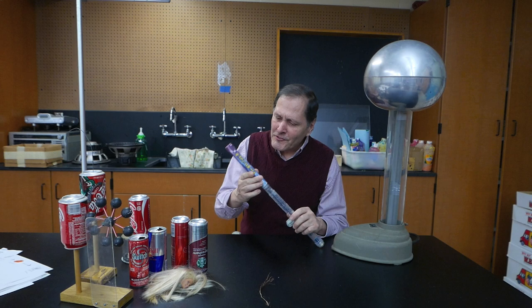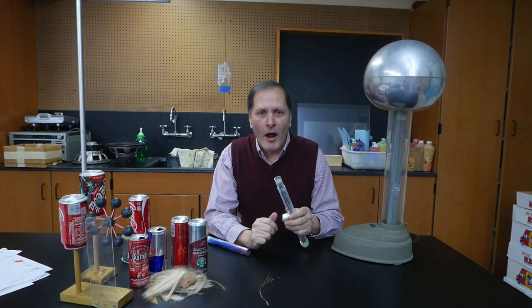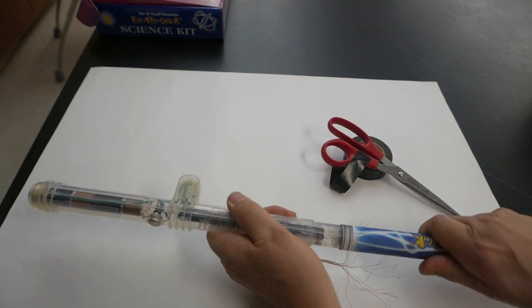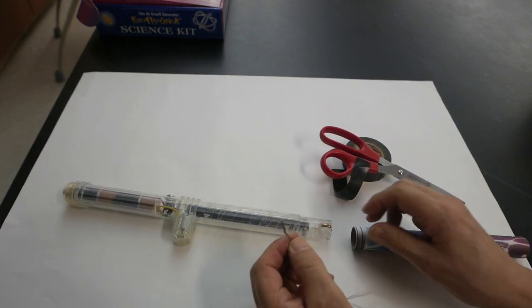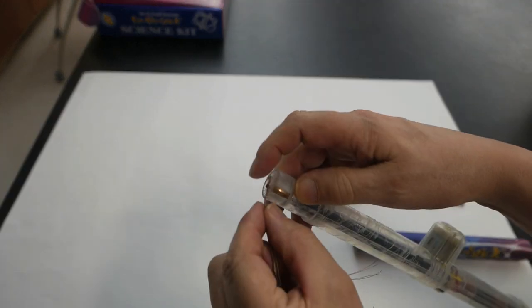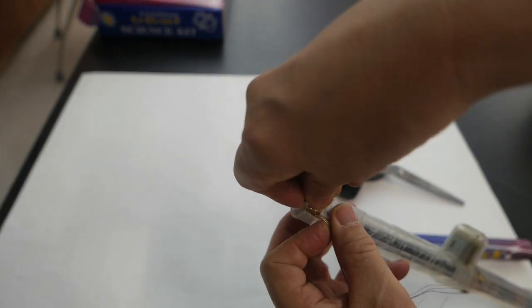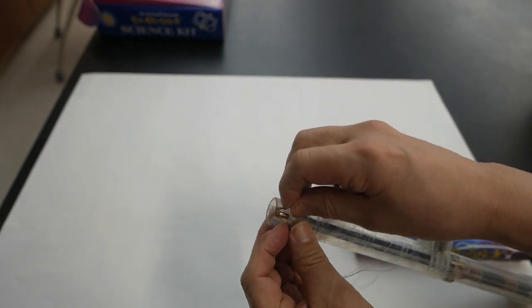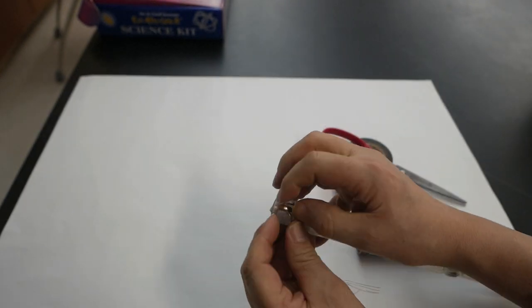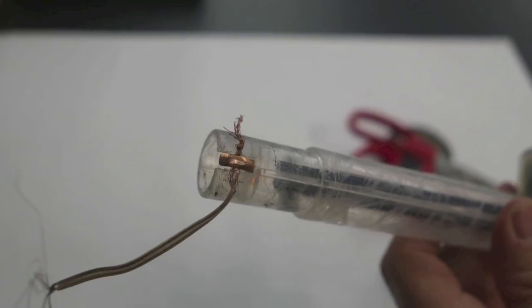So what I want to do is try and replace this cardboard tube with a metal container and see if we can get a much higher voltage. I'll start by adding an extension wire onto the electrode that's coming out of the fly stick. Now this wire was insulated, but I removed about an inch of insulation from this end. Now I'm simply going to bend it under the electrode. That will be enough to hold it in place. This is what it looks like.